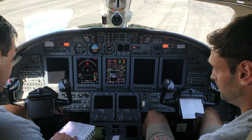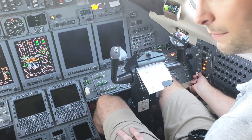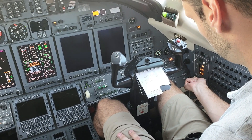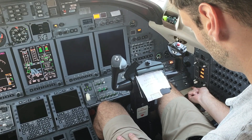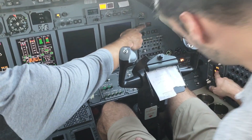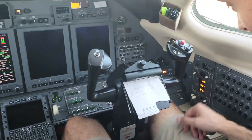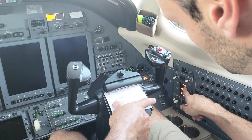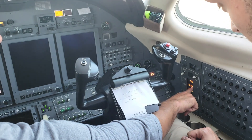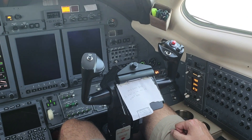Alright, avionics switch is ICAS APU to start. APU start — so this guy right here. Pull that and lift that up — that's the big button. Hold it and release. There it goes. The top is your RPM spooling up. Here's your APU relay, which just disengaged — the starter relay disengaged is good. That's RPM, these are the RPM spooling up. It's going to go to 101%. This is the temperature here in Celsius — it's 400 degrees right now.